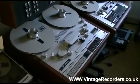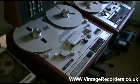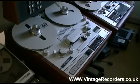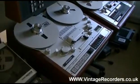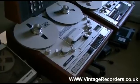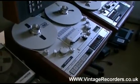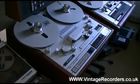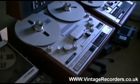Currently, both machines here are not working. This one has an audio problem where the output stage audio is inverted — it inverts 0 to 180 degrees and 180 degrees to 360 degrees to the plus and minus rails. In effect, when you put a sine wave in, you get a square wave out with a sine wave superimposed upside down.